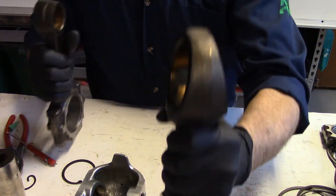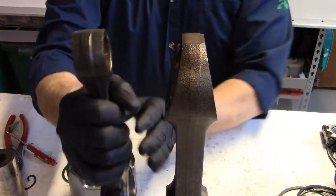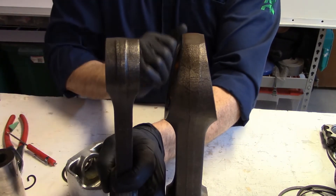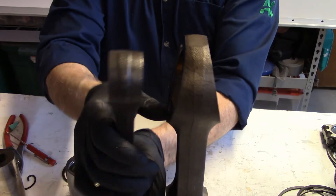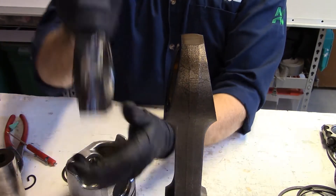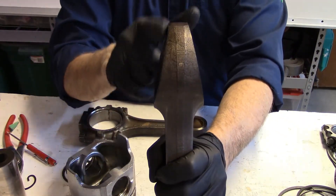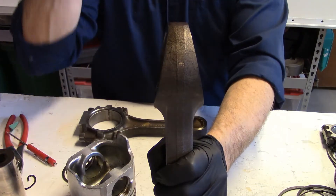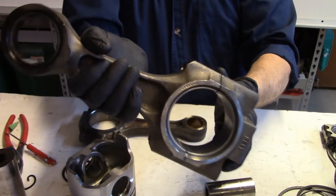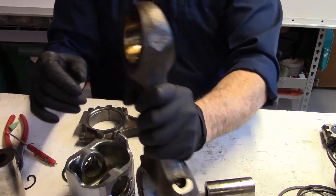Here's a look at two styles of connecting rods. The one on this side is cut square on each side — this is basically a traditional old-style connecting rod. The bigger one on that side, which you will find on most new engines, is a trapezoidal connecting rod. That trapezoidal shape happens on the small end where the wrist pin fits in.